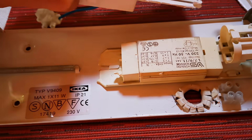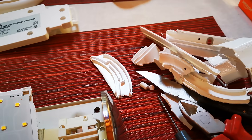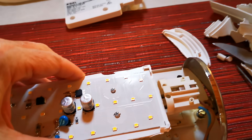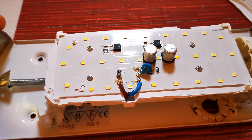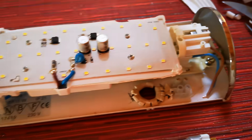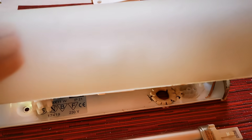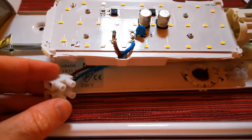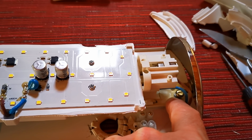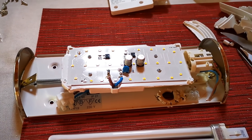I thought I'd retrofit this thing, and believe it or not, this hacked really well. I cut the oval shape out of it — there's all the leftover bits — and just cut an end out of that, so this will actually sit over that very nicely. It's just the right height for the diffuser glass cover to go over the top. That is going to be a winner-winner chicken dinner. I've just got to extend the terminal block back to the original terminal block, and I can have the original earth-in point as well. That's not a bad hack at all — I think this will work a treat. Catch you next time.